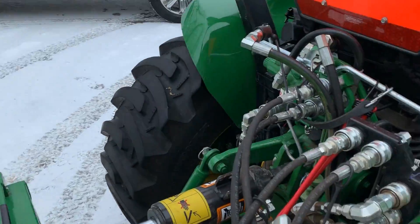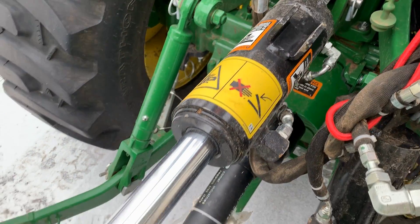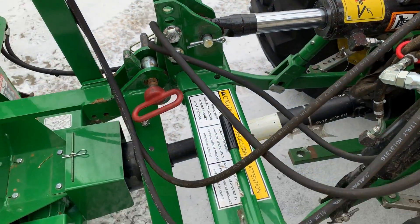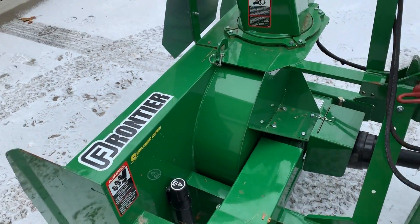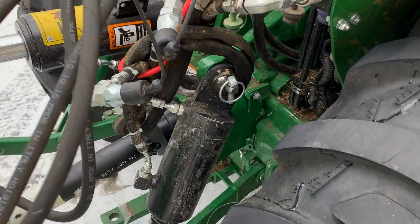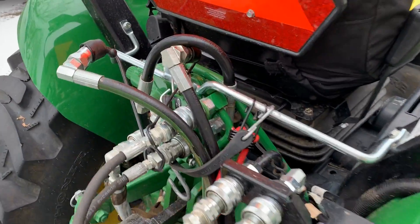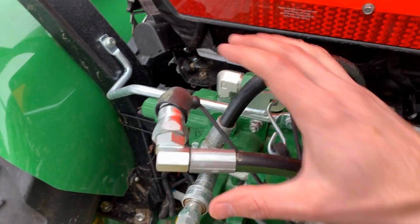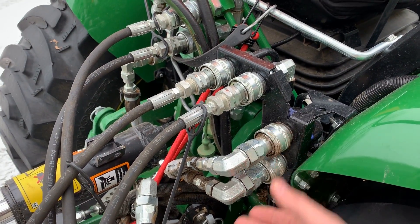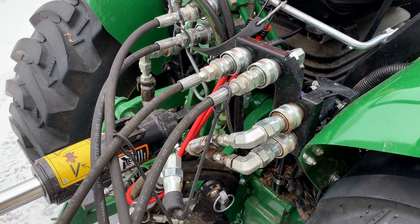The other valve is hooked into my hydraulic top link, which adjusts the pitch forward or back of my iMatch, as well as anything attached to the iMatch on the three-point hitch. I also have a hydraulic side link — I don't have any plugs for that at the moment, so those hoses are just strapped up and unplugged, ready to go if I need them. I'd just unplug the two hoses currently connected and plug those in.